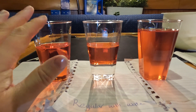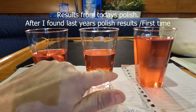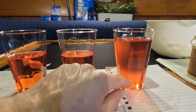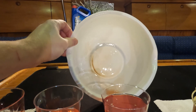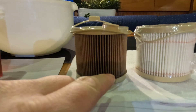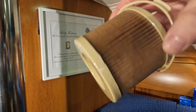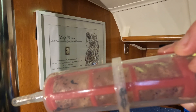This is the regular diesel here. The diesel with just water - I wanted to demonstrate how the water sits on the bottom, and this is where you get the bacteria growth. And then this is the part of the filter that was drained off. I drained it off in the bucket, which also has some residue inside. Moving along, we have the filters - this is the filter I used next to a brand new one, and I believe they are 30 micron.